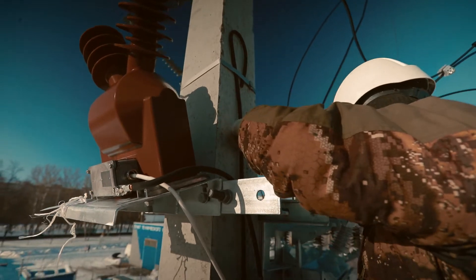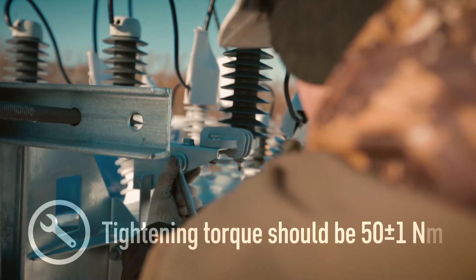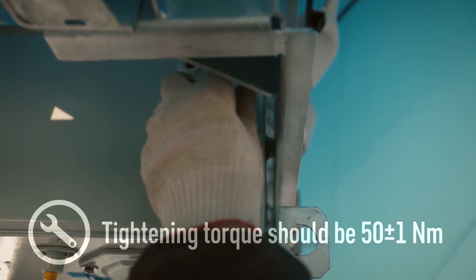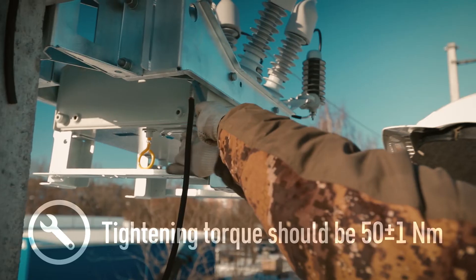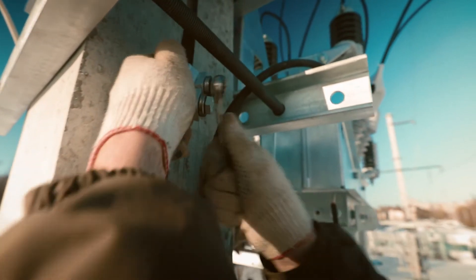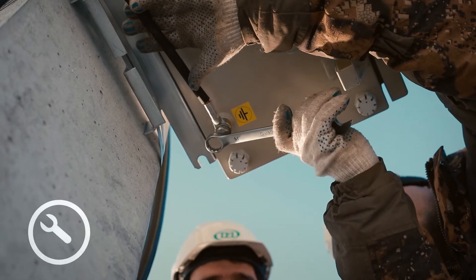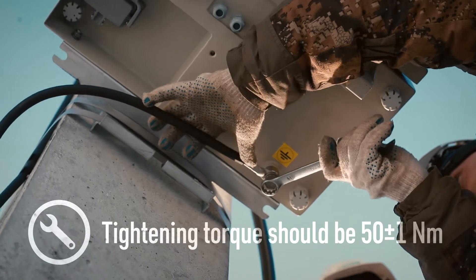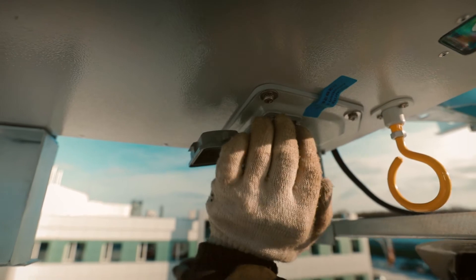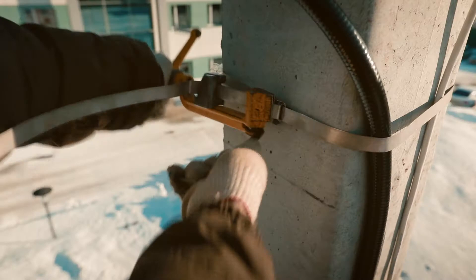The earthing process is very important in terms of personnel safety and protection of equipment from damage. Make sure that the OSM tank, mounting frame, RC and VT are properly connected to the same earth bus using separate earthing jumpers. All earthing points are marked with standard labels. Make sure that the system impedance to the ground is less than 5 ohms. Connect the umbilical cable to the OSM and RC and then secure the umbilical down the pole.